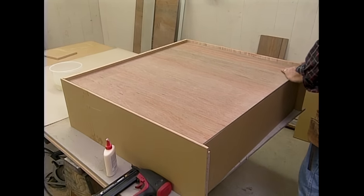A little bit of glue on the ends of the front 2x4 support — drop that into position and attach it with a few screws. Now I'm ready for the divider to which I'll attach the drawer slides later. A little more glue and some brads. That hole is necessary to access the adjustment screw on these leveling feet that I bought from my woodwork supplier — just glued in place and attached with a couple screws. That takes care of one of the base units. Before I leave tonight I think I'll build the other one.